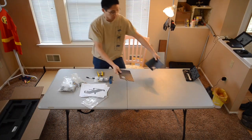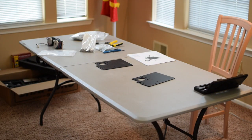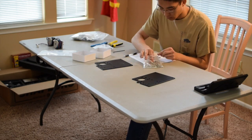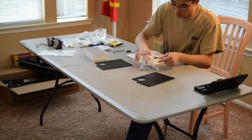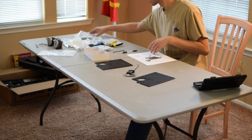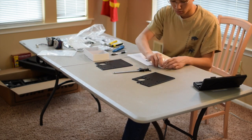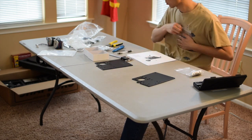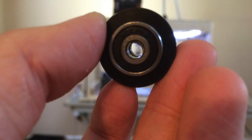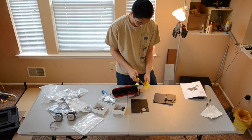Step two is the assembly of your Y axis carriage plates. It's helpful if you set aside all the hardware you'll need before each step. Your nuts and bolts are all sorted into four bags of fasteners, generally by thread size — so all your M5 hardware is in one bag, for example. Since your cap screws are all mixed together, it's useful to keep a ruler or calipers nearby to double check that you're picking out the right fasteners. You'll quickly learn to identify what's what after picking out a couple screws. Also worth noting: your V wheels come pre-fitted with two bearings sandwiching a washer, which saves you a step that used to be part of the Shapeoko 2's assembly process.